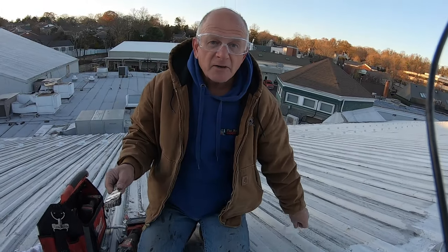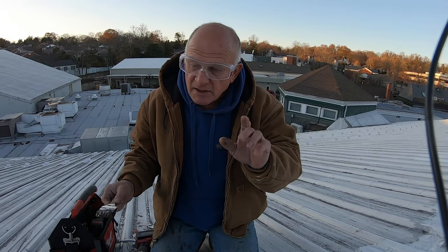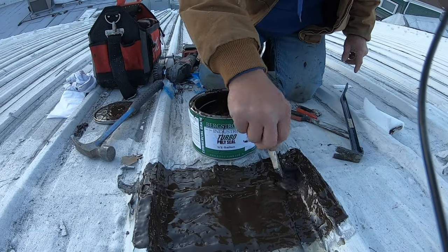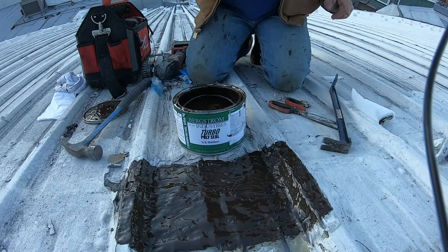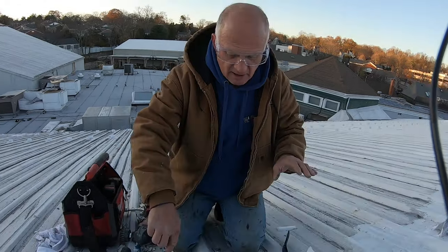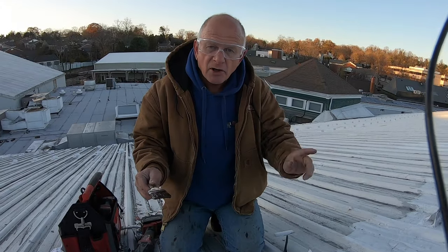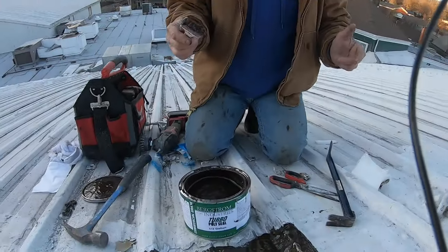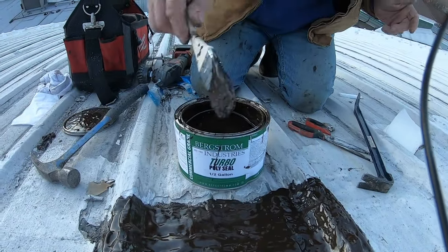This is how you fix the leak. Do I like coatings on the roof? My answer is absolutely not. Yes, fix the seams — but do it with a turbo poly seal or a better product. You cannot do it with acrylic. Acrylic is a paint; paint cracks, after it cracks water seeps in, it bubbles up, and it keeps water in. Coating is a bad idea. Turbo poly seal will do the fixing, but it's a lot of work to clean up first. That's it.